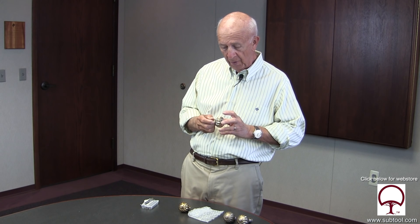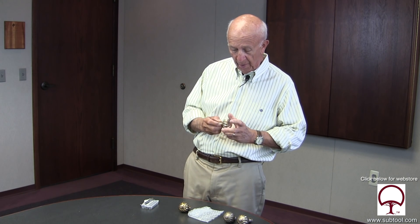So I got the idea of putting sandpaper with double-sided tape on the jaws. That really, really worked well — it made a huge difference in gripping it. And you could feel the cushiness when you're tightening it down because that double-sided tape has a little bit of foam in it, so it's got a little bit of give. So between the sandpaper, which didn't damage anything, and the foam, I felt we had a nice safe grip. It was a little scary a couple of times.